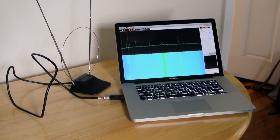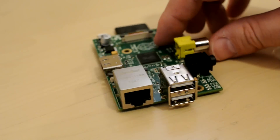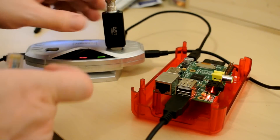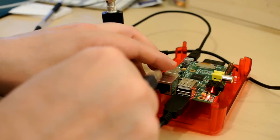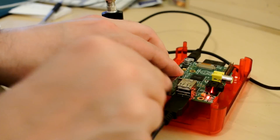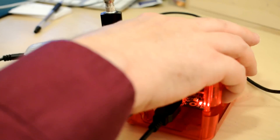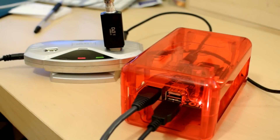As it's not always convenient to have the antenna and dongle plugged into my laptop, I ordered a Raspberry Pi, a $35 Linux microcomputer that's got built-in Ethernet and USB connectivity. Downloading, compiling, and installing the required support software was surprisingly quick and easy, and turns the Raspberry Pi and the dongle into an SDR server on my own network, allowing me to tune and control the system from my laptop as if the receiver was plugged in directly.